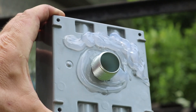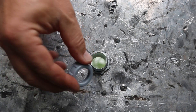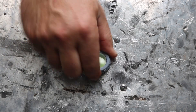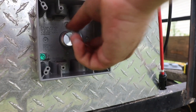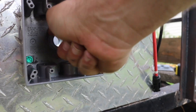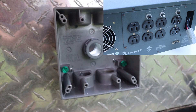I put some caulk on the back before putting it on. To hold the box in place I used four sheet metal screws and installed a conduit nut - it's one of those insulating bushings. Since this is metal it would be a bad wear spot for any wiring, so I put that on and it gives it a nice edge. I did the same thing for inside the box - the insulating bushing so there's no rough edges. And because the inverter already has electric outlets right on it, I'm basically just going to pass an extension cord through here for the electric outlets.